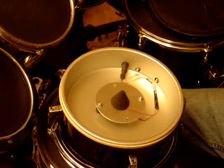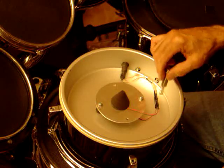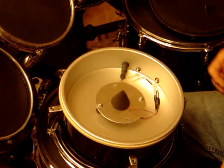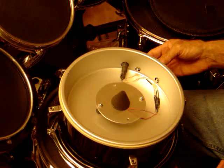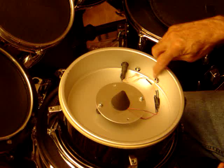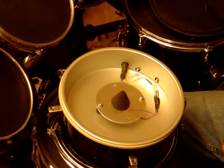There's the inside look. The jack is mounted through with some heat shrink covering it, and wires connect both the head and rim triggers. I had to do some clearancing in this case — this uses a small tubular mount and the bolts holding that on hit the cake pan a little bit, so I drilled some holes to clear those out and everything fits nicely.